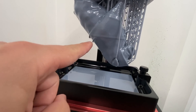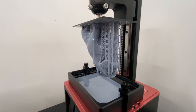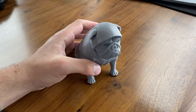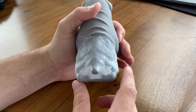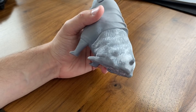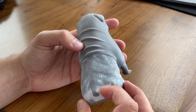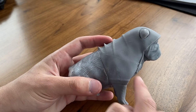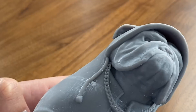There's a layer shift here — that's my fault, that's where I topped up the resin. First print is a success! Let me clean this up and show you guys the detail. This is print number one, the Bulldog. The white stuff is because I left it too long in the UV black light curing chamber — I forgot about it and it overly dried. The layer lines are smooth though, and if I were to paint this you wouldn't see them. As you can see, it's very detailed.